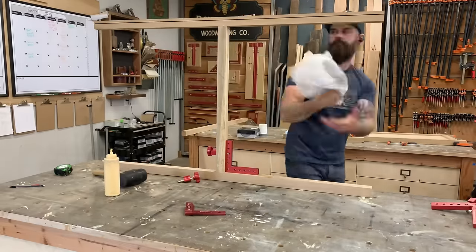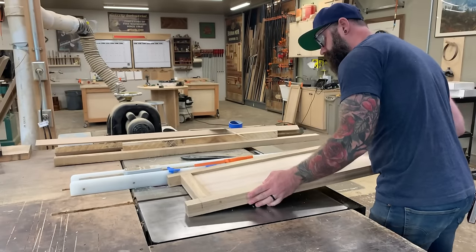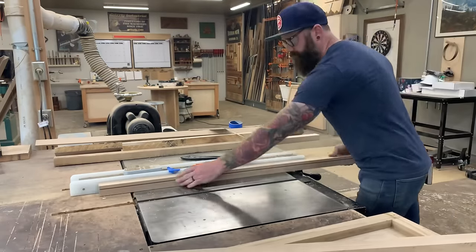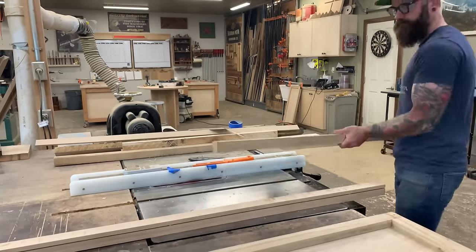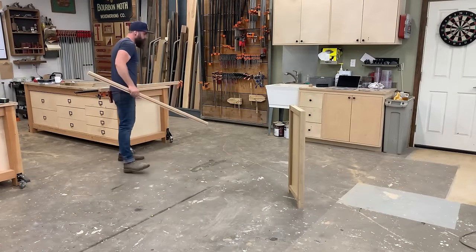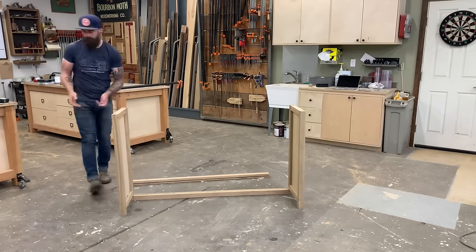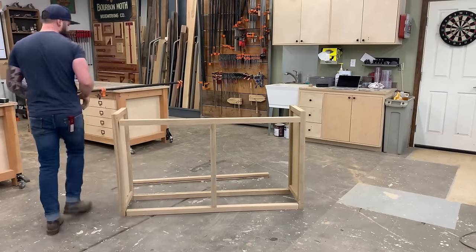This is the portion of the video where I tell you I forgot a few steps. When cutting my side pieces and adding the quarter-inch groove for the floating panel, I completely forgot we also need quarter-inch grooves for the back panel. So I had to add that groove to my back support pieces as well as my two side pieces — a little easier to do before glue-up, but it worked just the same.